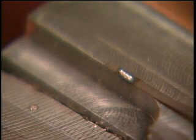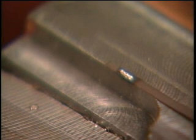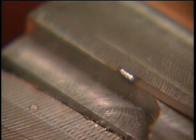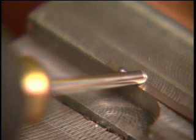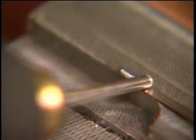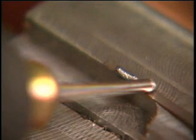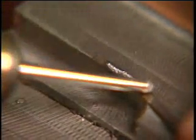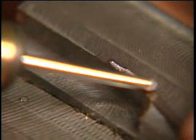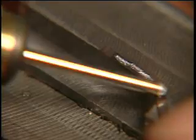When a curved area is encountered, the repair material can slowly be formed around the curve using slight pressure on the free end of the repair material. Each time the Mold Mender makes a weld, the repair material is momentarily plastic, allowing you to slightly realign the repair material to follow the curve. Notice that to make a continuous weld, the electrode is rolled slowly enough so that each successive weld overlaps the last. This will bond approximately a 1/32-inch diameter spot each time the unit is triggered.